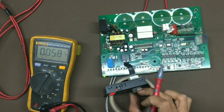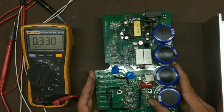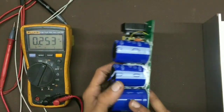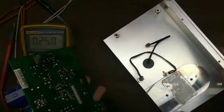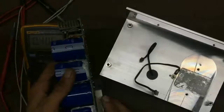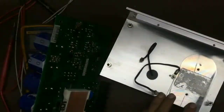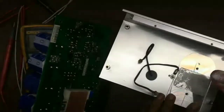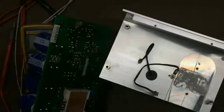That drive is ready. Now we will turn it off and assemble the drive, then test it again. As you can see, I have re-soldered the capacitor bank. First of all, we have to clean the old coat of heat sink compound — it is very important, guys; it will transfer the heat. Use a little bit of thinner or petrol to clean this.